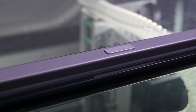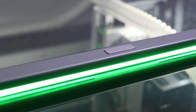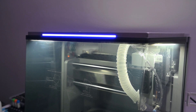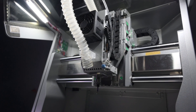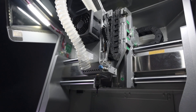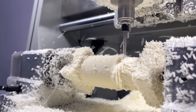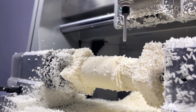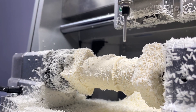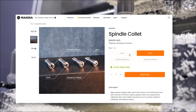There's also a handy button right on top of the machine to confirm the tool changes, so you don't have to go back to the screen. The built-in LED indicator on the front makes it easy to see the machine's status, letting you know exactly when it's time to swap out the tool bits. The machine is equipped with a 200 watt spindle for milling and engraving, capable of reaching speeds of up to 13,000 RPM. Even though the power rating might seem a bit low, I had zero issues with its performance. The spindle uses a collet system designed for standard 1/8 inch (3.175mm) bits, but you can swap in other collets for 1/4 inch, 6mm, or 4mm sizes.